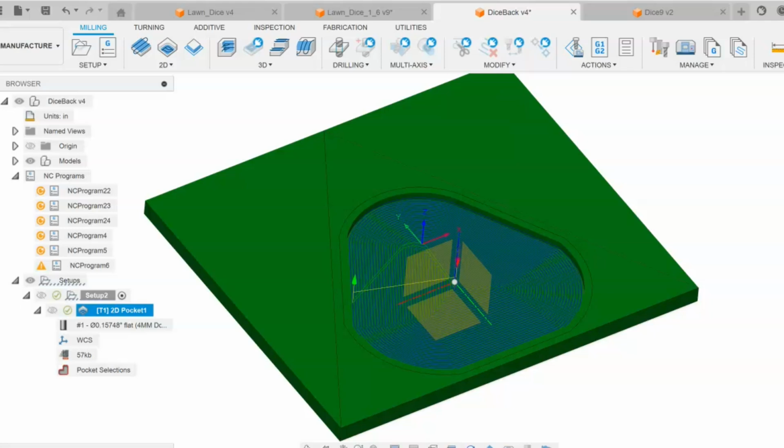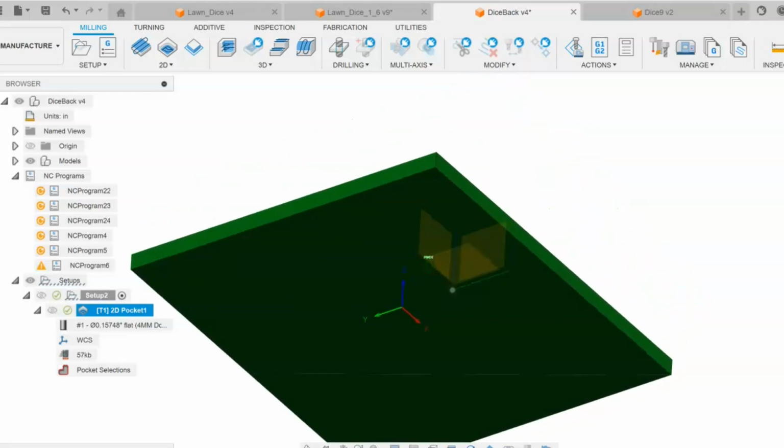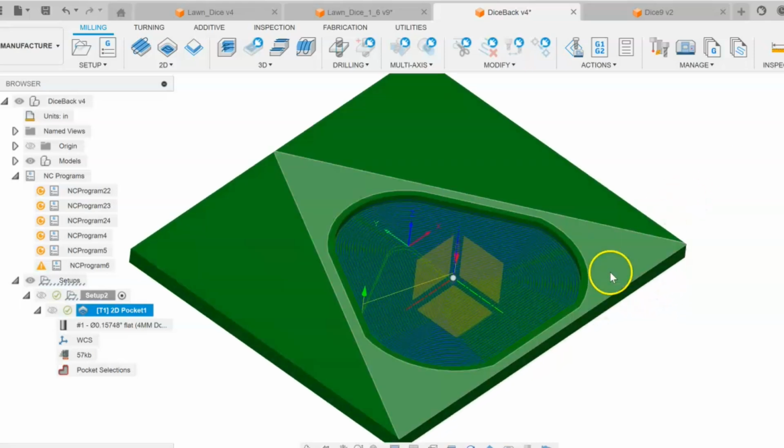Once the epoxy was cured and the faces sanded, I made one final cut to the back of each section so that I could make these D20 numbers translucent. I achieved this by flipping over the part, inlay side down, and just milling out a pocket in the back of the triangular section, just deep enough to cut through the bottom of the epoxy layer, which in this case was just over a 1/4 inch.